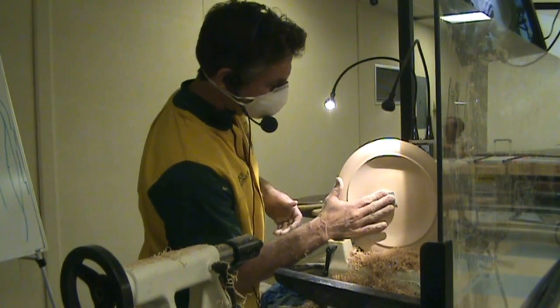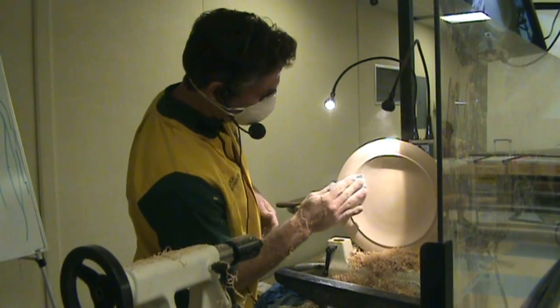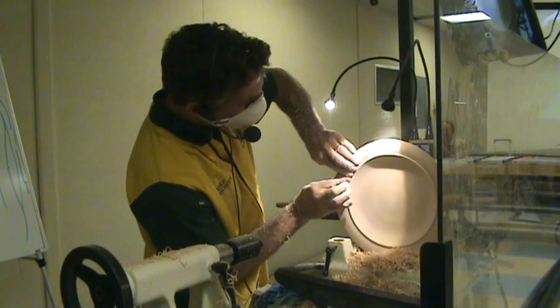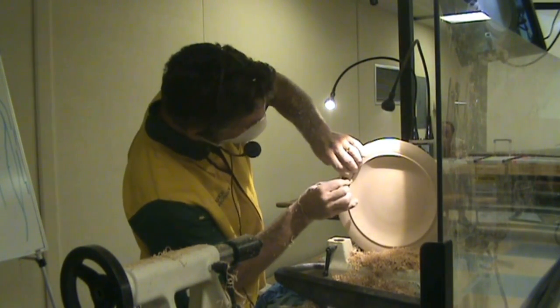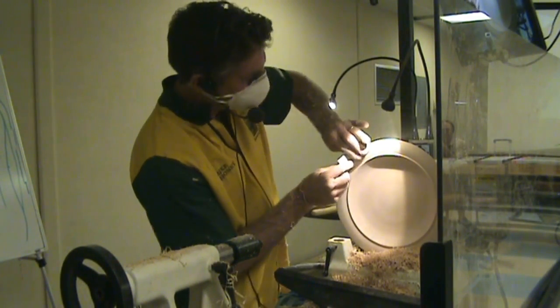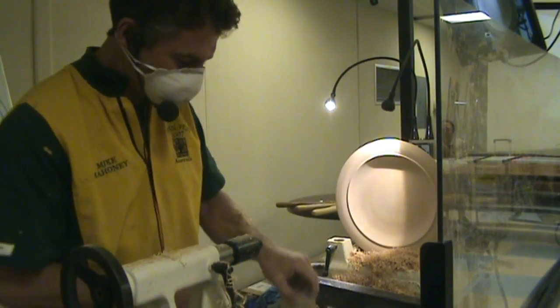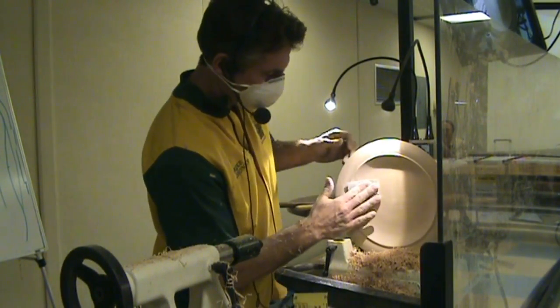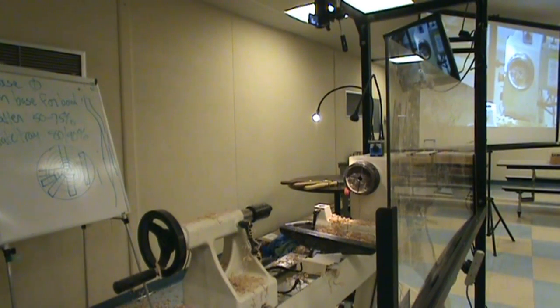I think I need a little bit more attention with 150. I'm also knocking off any sharp edges but not knocking the detail out of the work. You can always tell when somebody has over-sanded — by knocking out details that you wanted but now they're gone. There's some 220. It's not sanded great, but that could be a nice item. Being that it's a maple, it could be used in the kitchen daily and shouldn't have any problems for sure.